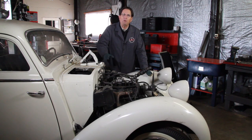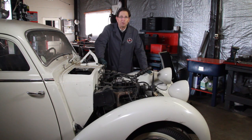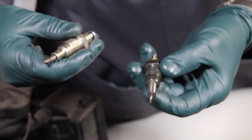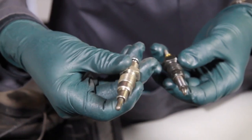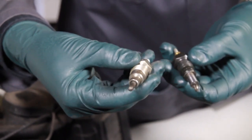For years people have always been trying to improve the performance of the old OM 636 four-banger. I've already made an improvement to my 180D and I want to do the same thing here to this 170D — that's to change out the glow plugs. The original glow plugs are an old loop-style series glow plug, and I want to install the upgrade fast pencil or parallel glow plugs in these engines.